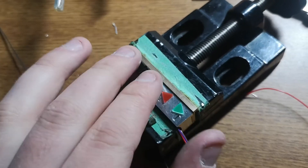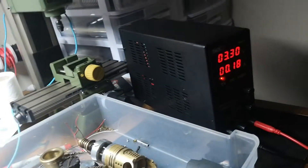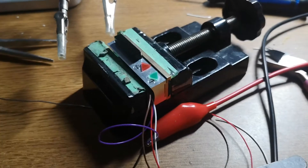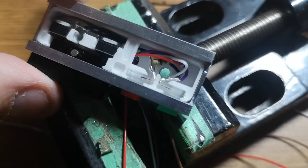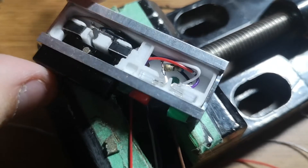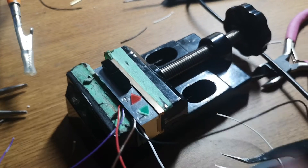At this point, our standard procedure is going to be testing all our leads — checking continuity in our switches and whether our LEDs work. I now have this hooked up to my benchtop power supply, driving 3.3 volts at 18 milliamps. This is why it's important to test your wires before you assemble everything: it turns out I wired my red LED backwards, positive on the negative and vice versa. Since we checked that, I can fix this instead of tearing apart the entire build. I have the box assembled and the device clamped together to simulate conditions in the hilt, making sure our screws aren't shorting anything.